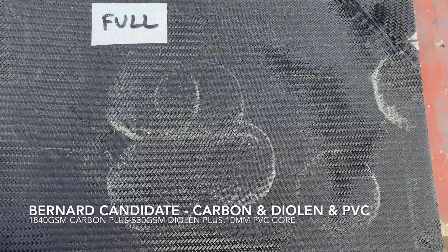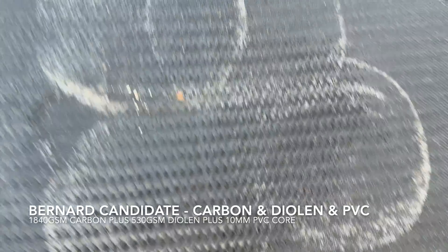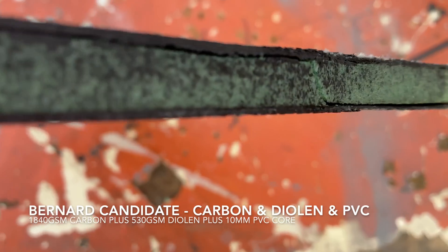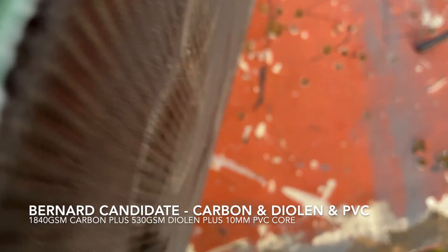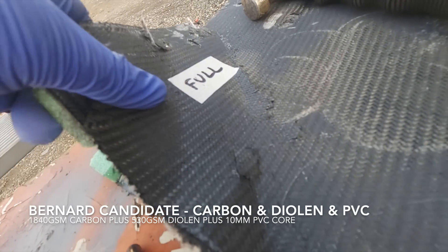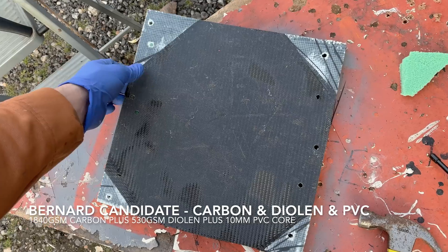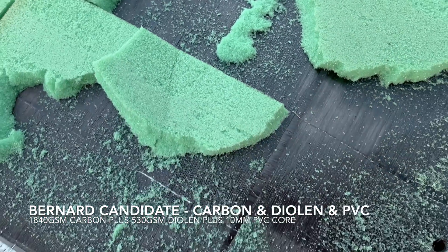Going into more detail: from all of these two dozen or so impacts, from the ones in the middle I can only see one major indentation — presumably the foam beneath is very slightly crushed. More obvious is the damage to the edges, where I hit with about 120% of the force of the pendulum swing hammer. The foam has compressed by about a quarter, but the carbon remains bonded to the foam and looking okay. There's a slight separation from the core, possibly due to a little less epoxy resin used at the periphery. The reverse side looks mucky but untroubled. I grabbed a corner and yanked to see the innards — the carbon did seem to fold more easily around the points of maximum hammer impact. Inside, a random series of diagonal fractures through the core, mostly caused as I forced the separation. Good bonding of the foam to the carbon, but a mental note to not be stingy with resin, as foam-to-laminate bonding is critical, even if we use some tongues of carbon through the foam to link the two sides.